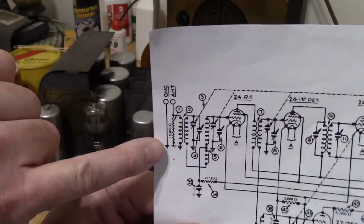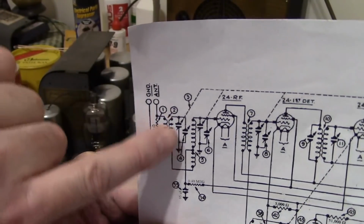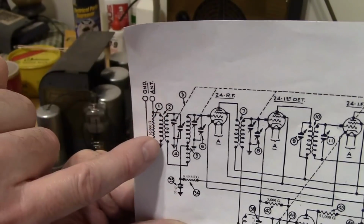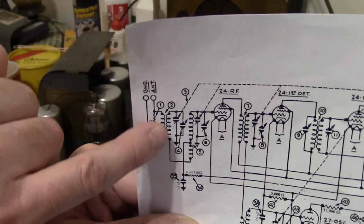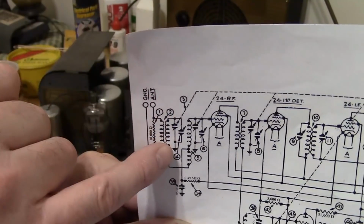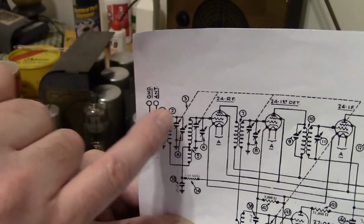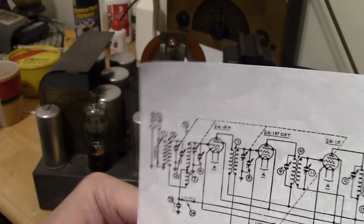Okay, after that, we've got two coils of wire, with the number 2 pointing to it. When you see one part designator pointing to multiple elements, it's a pretty good indicator that these are one piece. So if there was a 2 and a 3 pointing to each of these individually, there could be two separate coils. But since there's one designator pointing to it, it's a good indication that it's a single part, even though there's no dashed line or anything to indicate that this is all one unit. But it is. So where is it?